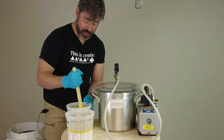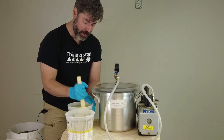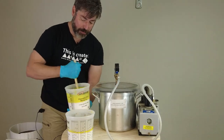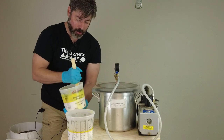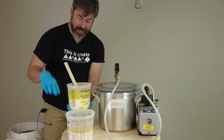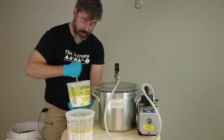For those of you who want to see the degassing process, I brought my vacuum chamber right up here so you can see it. We're going to subject both of these buckets to a vacuum as soon as we get them mixed up. Always make sure you have enough room in the mixing bucket to allow for that expansion — when you subject the silicone to a vacuum it's going to rise and then collapse, and you want enough room for that to take place.